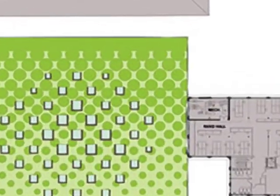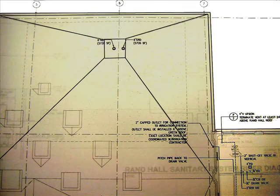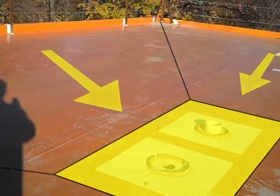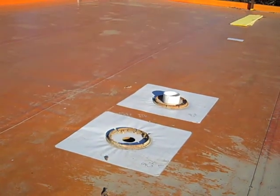Aside from edge gutters, the roof also slopes into internal roof drains. Beneath the eventual green roof plantings, the concrete topping slopes to a lowered area with a pair of drains. One is the regular roof drain and the other, with a raised flange to prevent water from draining into it under ordinary circumstances, is the emergency or backup drain.